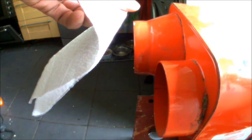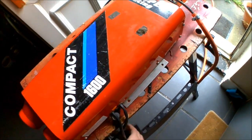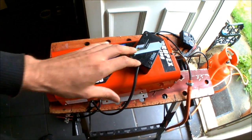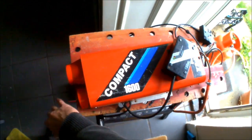That's kicking out nice warm air there. If I put a tissue in front of it you can see the airflow is blowing the tissue away, and if I put that near the intake it's sucking in. You can hear the burner kicking away and that's nice warm air coming out of there. It shows the unit's working lovely — it's just ready to be fitted now. They're not quite as noisy when you've got your proper exhaust and intake pipes connected and your ducting vents connected; this is just the bare unit in the open air.